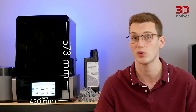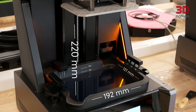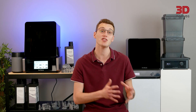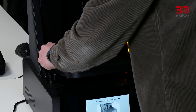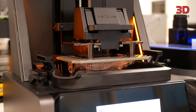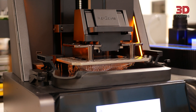The hardware itself boasts a footprint of 400x420x573mm and offers a decent build volume of 192x121x220mm. It's a hefty machine too, weighing in at 25kg, but that weight reflects a solid construction. On paper, Heygears makes some serious claims, promising an XY precision of 33 microns, a minimum layer thickness of 30 microns, and a consistency of plus or minus 16 microns with 90.6% restoration. Overall, the Reflex feels pretty sturdy — constructed from a combination of metal for structural parts and plastic for aesthetic aspects. It uses MSLA technology, providing high accuracy and resolution at an affordable price point compared to other technologies such as SLA and DLP.